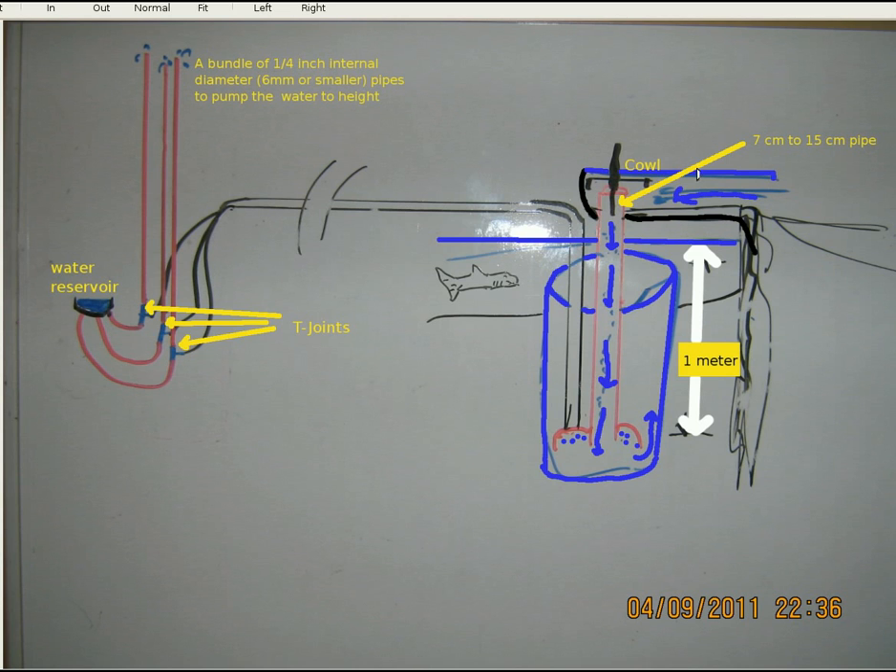So this is the Pulsar Pump Nano idea. Basically you would have a tromp section with a 7-15cm pipe that will have say half a metre head, or less — say from 35cm to half a metre of head. You will have about 1 metre of depth to your tromp. So it is a very low pressure tromp and that is why I am calling it Pulsar Pump Nano.